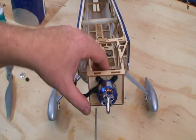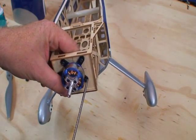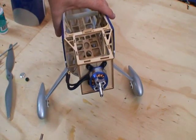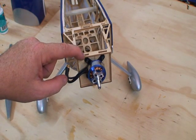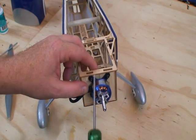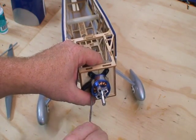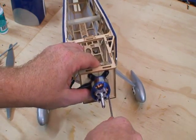We've got these tightened down. If you're familiar with Loctite and want to use it on these screws, the correct color is blue — not red, blue. We're not using Loctite on this install because if you get the right amount of torque and give it a good crank down with your hex driver, these don't tend to loosen and you don't specifically need Loctite.